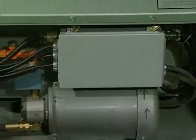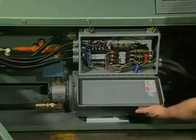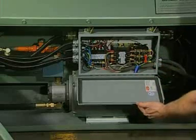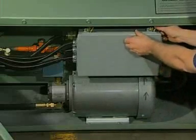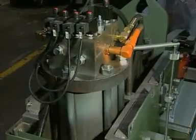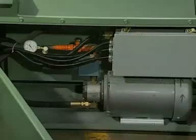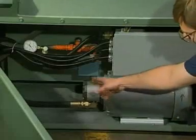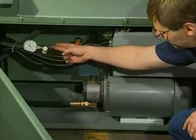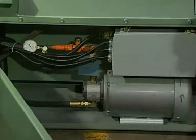All Piranhas are shipped completely wired through the electrical enclosure. You may either wire an electrical plug into the enclosure or wire the machine directly into a fused disconnect. Make sure your incoming voltage matches the motor voltage. The hydraulic cylinders and control valve unit are located between the machine's C-frames. The motor, hydraulic pump, and hydraulic filter are located inside the cabinet. A pressure gauge is included for diagnostic purposes only and should not be used under normal operating conditions.